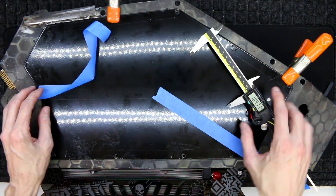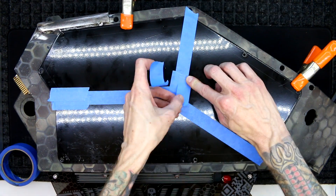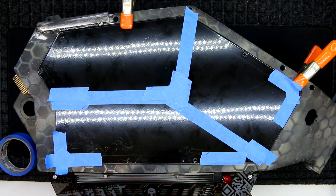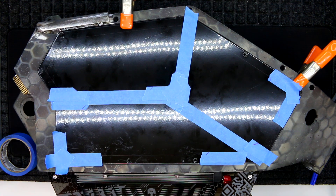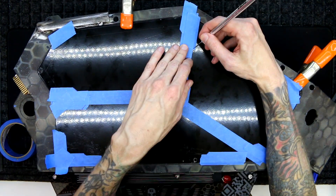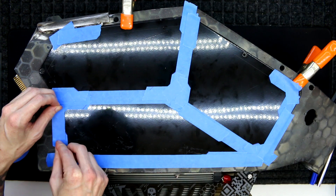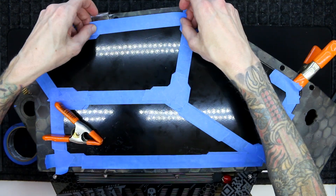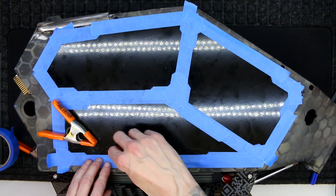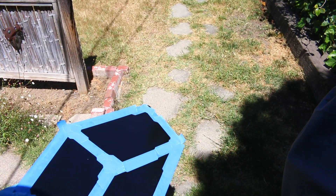Plastic would have been lighter, but the issue was I needed a way to affix it to the frame. I can't use screws because I have literally zero space on either side of the panels — the battery takes up all of that space. So I ultimately decided to go with the original steel side panels, because being steel I can weld them directly to the frame. The pattern I'm laying down here isn't exact to my original drawing — it just had to be somewhat similar, so this is all kind of freehand making these little dips and indentations. Even though these extra details were a lot harder to cut out, I think they were worth it for the aesthetics.